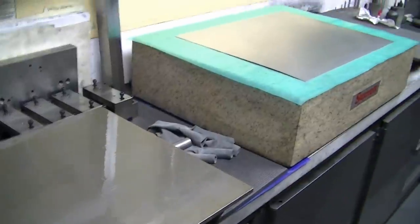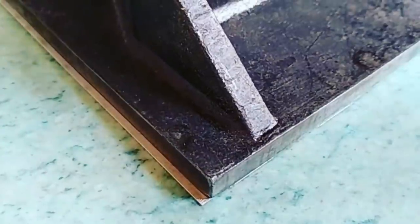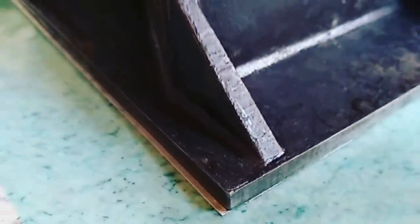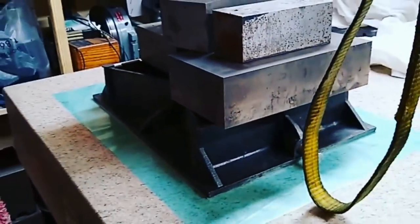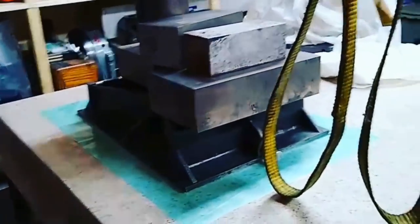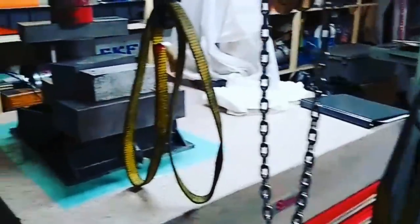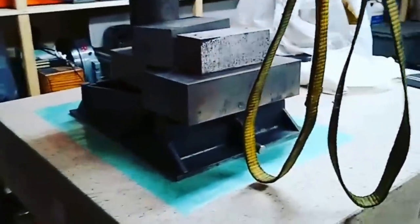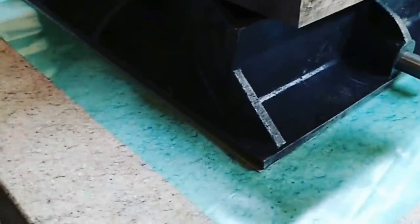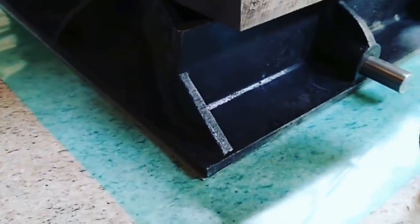And that's it. And we have touchdown. Flipped the plate over, lowered it onto the aluminum on the big plate. Decided to come out here and use the crane with the spreader to be able to carefully lower it down onto the acrylic adhesive. And very, very little exuded out, so that film thickness and thick amount was pretty close.